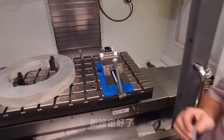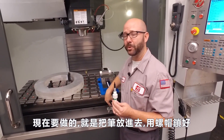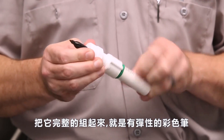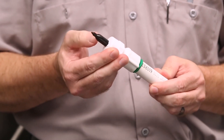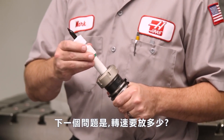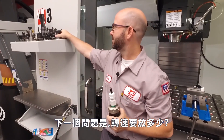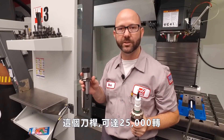We're all set. All we've got to do now is drop in our marker, take that cap that we just finished machining, and screw it on. We now have a fully assembled, spring-loaded part marker. Let's load this up into a holder. The next question is: what RPM do we run this tool at? This holder comes out of the box rated for 25,000 RPMs.